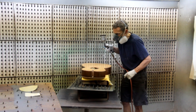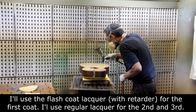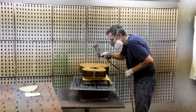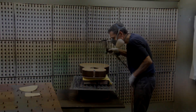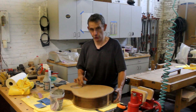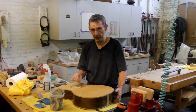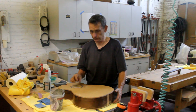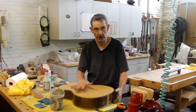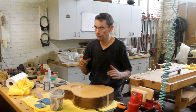I'll apply one coat, let it dry an hour, apply another coat, let it dry an hour, and then apply one final coat about as thick as I can. If you were paying attention, I'm sure you noticed that I was only spraying the sound hole area. That's the reason I used the retarded lacquer — I want it to melt into the rest of the finish that I've already polished to gloss. You don't want to have to redo the whole top if you don't have to.